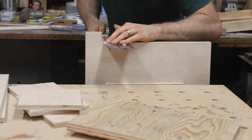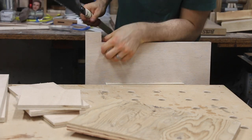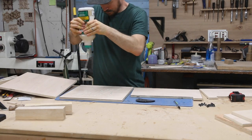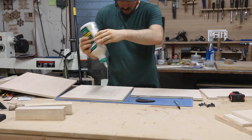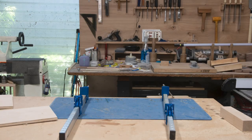I just needed to do a quick touch up with a handsaw, then I could glue together the table and disc parts. I decided on a lamination for these two parts to guarantee flatness. Half-inch plywood is a bit thin to stay perfectly flat on its own, but two pieces laminated together have that rigidity.